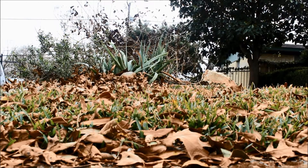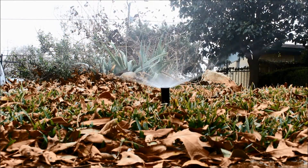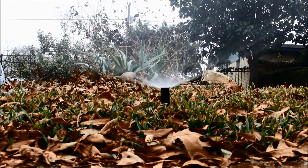Weather and certain ground types, such as rock and clay-filled soils, can cause water waste from a sprinkler system. Converting sprinklers to lower output nozzles can help to reduce this water waste by allowing the water time to absorb into the ground rather than runoff. These nozzles will also convert the water spray pattern into a stream pattern, which will help to combat any wind issues.